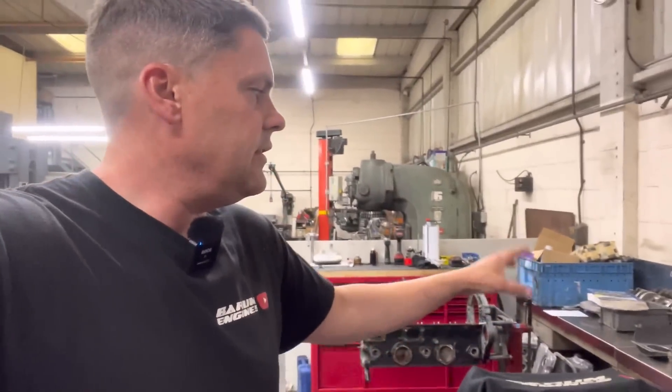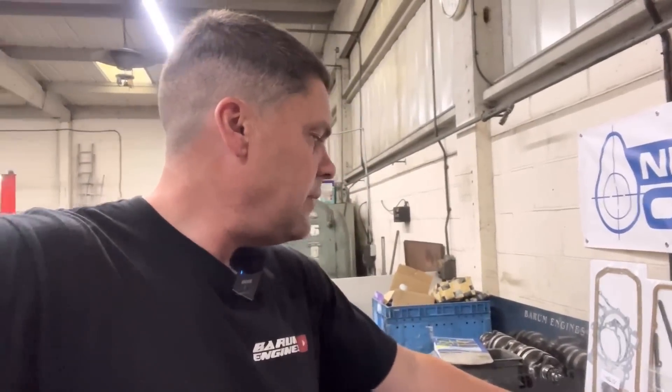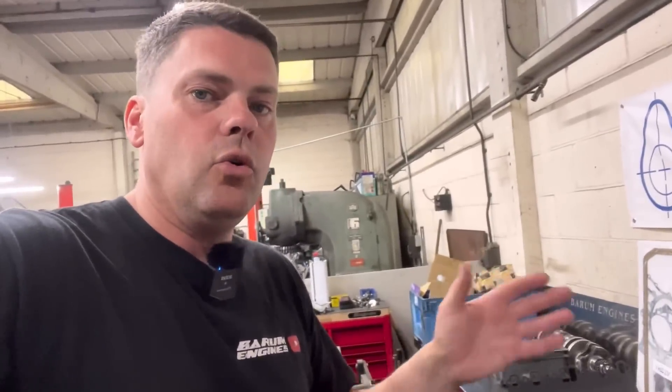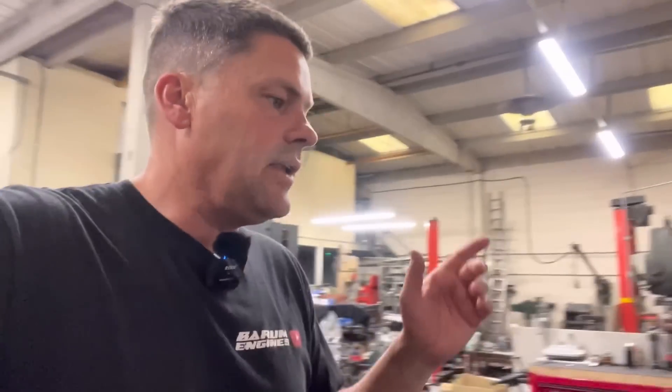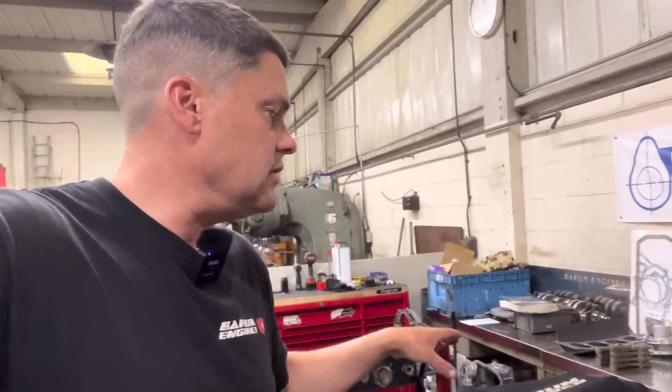The V8 — this is the V8 that's been ongoing for a while. All we're waiting for is the crank assembly to be balanced, which is all done, and it will be back tomorrow from CTM Performance. We can't balance the Rover V8s at the minute, or any V8 to be honest. So what we do is size the con rods, then balance them. Same with the new pistons. We send a piston assembly and a con rod with the crank bearings and bolts for one cylinder, the crank and all the bits in line — the clutch, the flywheel, all the relevant bolts and the front pulley — and they balance that as one unit. That'll be back tomorrow, so Paul's job when he's in on Thursday — which is tomorrow because it's Tuesday now — he's going to crack on and start building that, because everything's pretty much done.